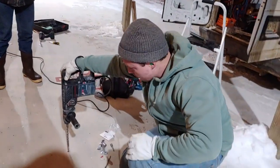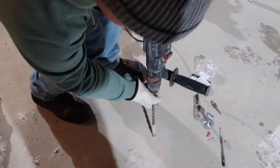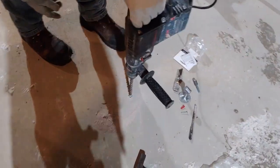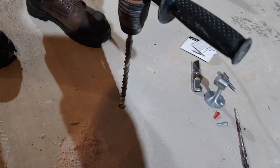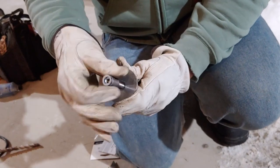First, the 5/8" hole. I always like to move and look from multiple angles as you're drilling just to make sure it's going sort of straight down. We're down to about two inches — that's more than enough. We probably could have gotten by with about an inch. We're just going to thread it all the way down so that it's basically touching.